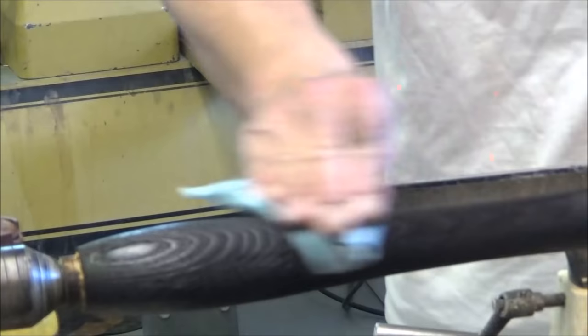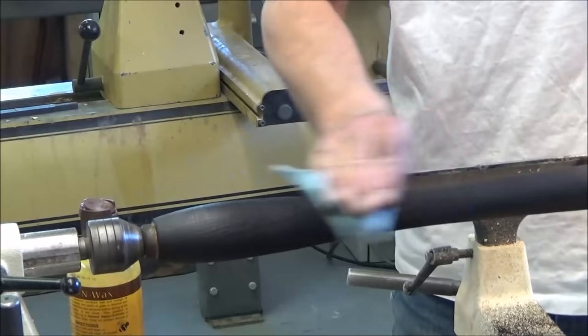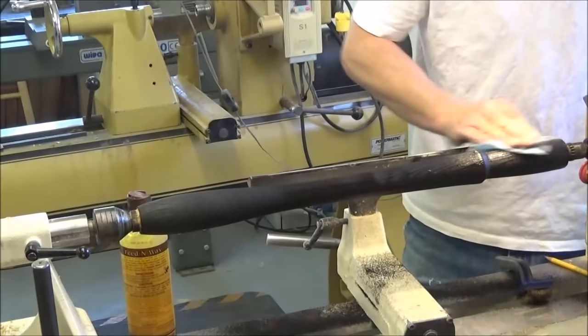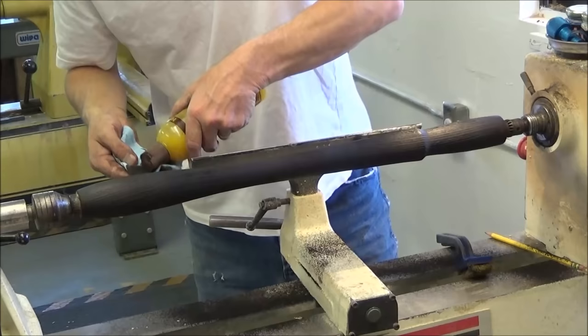There you go. It dries very quickly — as I say, that handle is still hot. It just gives you a real nice satin sheen. It goes on shiny but it's going to dull off slightly as the wax dries. The handle's still warm and it's drawn the wax into the handle — it's not just a surface finish. Don't be shy with this stuff — it'll soak right into the wood. Look at that mixing: jet black. So all the carbon's mixing with the wax and we're getting a really nice finish. Get it right down into the grain of the wood.